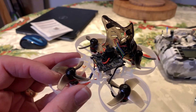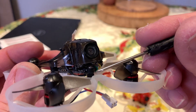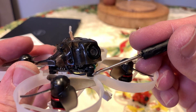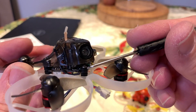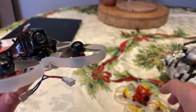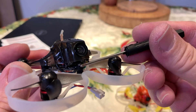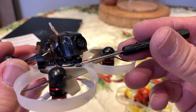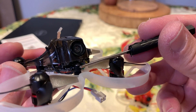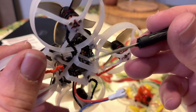This is what the final modification looks like. I now have proper grommet spacing — half grommet on the bottom, full grommet in the middle, half grommet on the top. On the front I have a screw to hold it all in place, since it didn't have one originally. I have a Happy Model Snapper 7 where I had to do the same thing, because the flight controller tends to creep up and dislodge and fall out of the groove. This keeps it all in place.